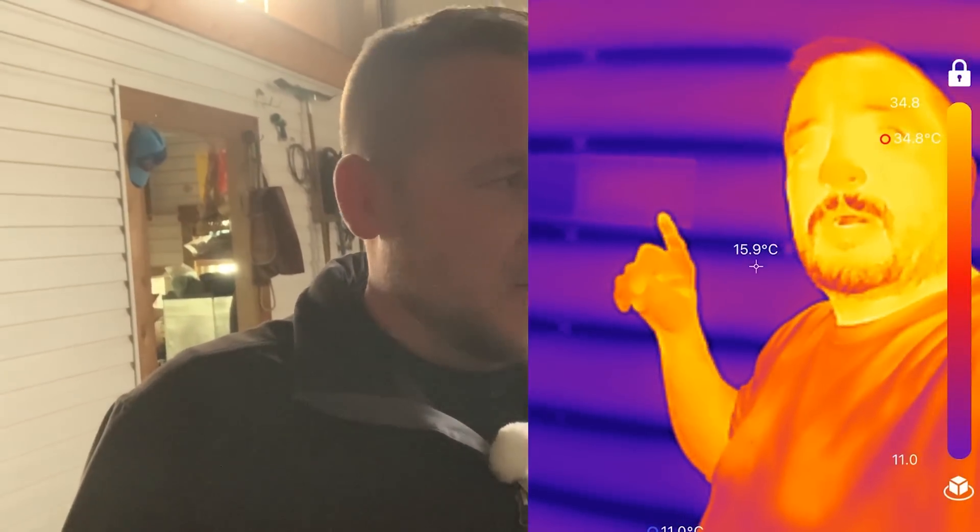My shop is very, very efficient except the south side has two massive overhead doors taking up almost the whole wall. I knew that was a weak point, but just how bad? It's pretty bad. On the outside looking at my shop I can clearly see the heat escaping, and on the inside you can clearly see how inefficient it is. My plan is to do an accordion style or some sort of additional door on the outside with an air gap to fix this issue — that's where all of my heat loss goes.